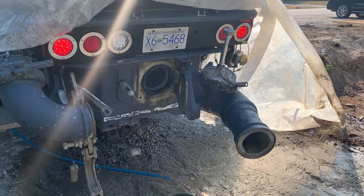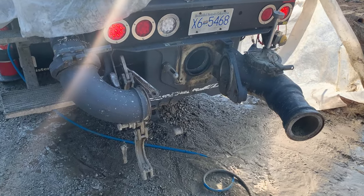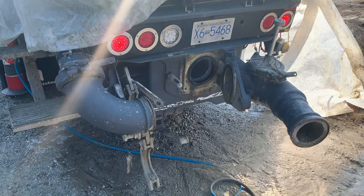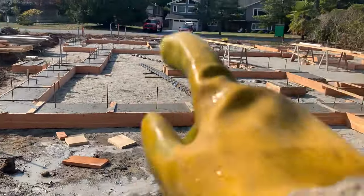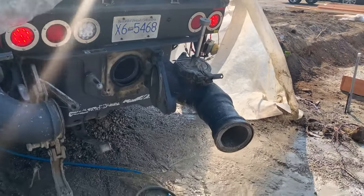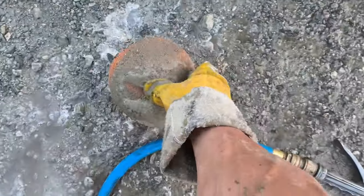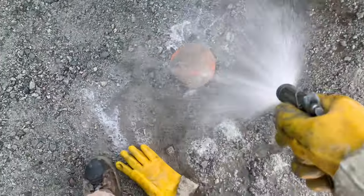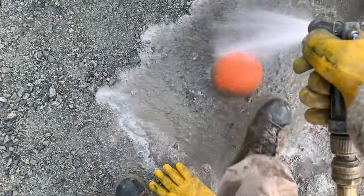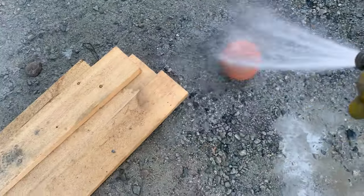Okay, so yes, I am typically a big proponent of doing sponge, water, sponge, double sponge for spotlessly clean pipes. Today, because we're just doing some residential footings, it's just a regular low strength residential mix, not a ton of cement or fines in it. So what I got is a single medium density round foam sponge, and I'll put lots of water in front of that.